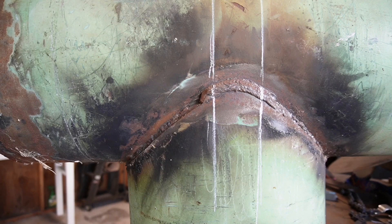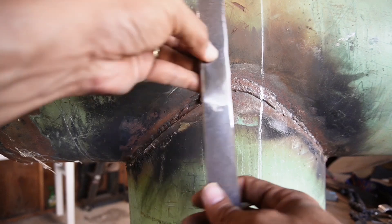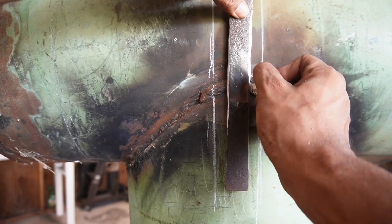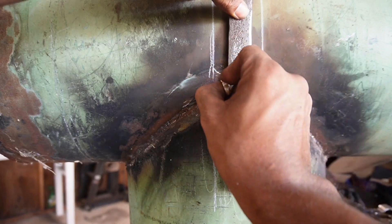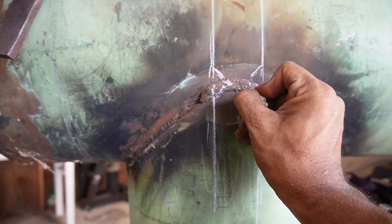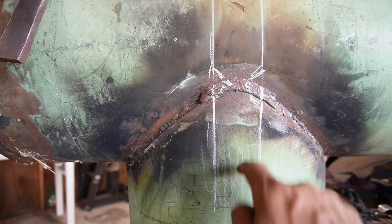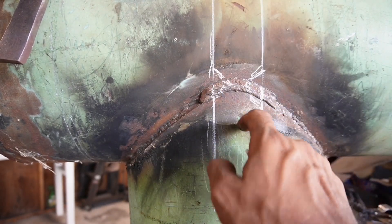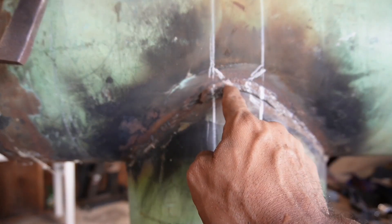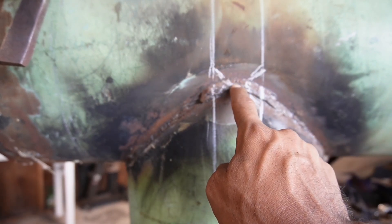One thing to know is that depending on your inspector, your inspector might want you to go an inch in the middle right here, so you'll do a little V-groove here and a little V-groove that way. This one-inch section is what you will turn in, depending on what the inspector wants. Sometimes he's going to want the whole strap and they'll test that whole section, or sometimes you'll leave an inch — cut straight down, come in at an angle, go back down, and leave that area. That's where you're going to be using a nick break.